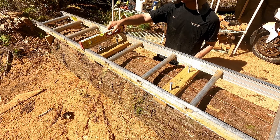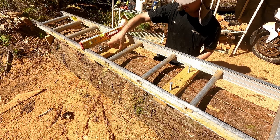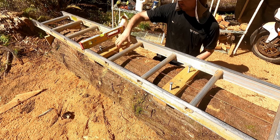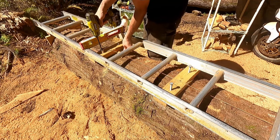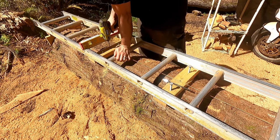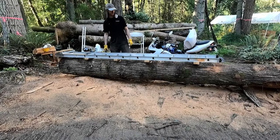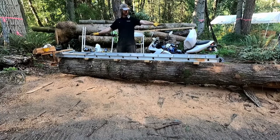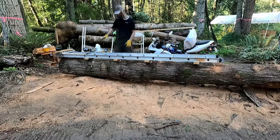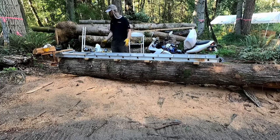Now I go down to each block, put the level on it, and run the two screws down until they're touching the log, with the string a quarter-inch above the top of the 2x4. As I'm happy with each one, I screw it down and move on to set the next one. The ladder is set up — fixed offset from the datum blocks we set on the ends of the log, level and straight, so it should create a good plane for our first cut. Chain is sharpened, oil tank is full, jig is adjusted to the right depth. For the next 10 feet — the length of this ladder — this cut goes just like any other.